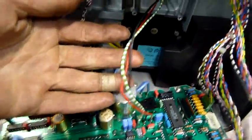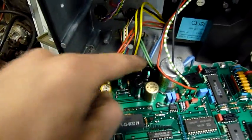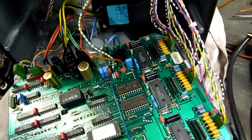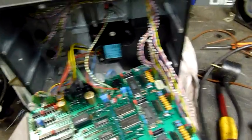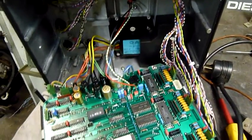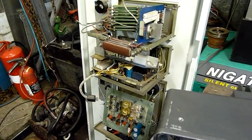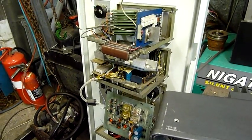That's the voltage regulator. Got AC input from the transformer as well as a variety of other leads coming out of it. Each one's fused. Very old electrolytic capacitors. This thing's probably from the late 70s — the last two digits of the serial number are 78, and coincidentally the breaker that came off it says 1977 on it. So I'd say this is a really late 70s EDM machine — electrical discharge machining center. Just looking at the componentry on it tells me it's probably late 70s, early 80s.